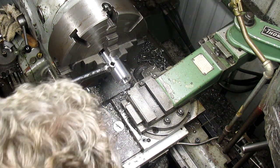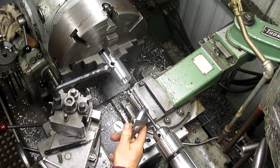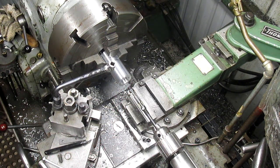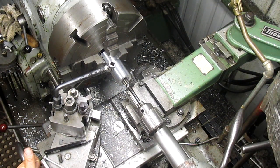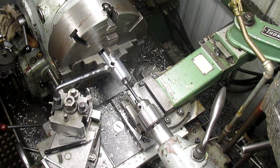And we're going to bring our adjustable reamer in. And I've already made my cut. So what I want to do is adjust the reamer. So I'm going real slow because the last thing I want to do is make this thing too big. So we're just going to take it a quarter turn, run it in there, and see what we come up with.